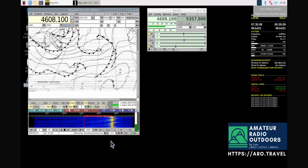And then once the transmission starts, you have to make sure that, as you see here, you have the left line, the right line of your center frequency in the exact middle of the transmission here of the right channel, and this one in the exact middle of your left channel. So as you can see, they have to be in the exact middle. If you do that, what will happen is that the image will be perfectly centered and you will not have any issues.